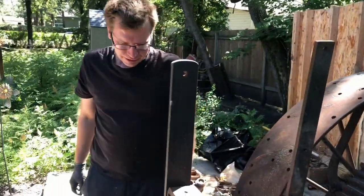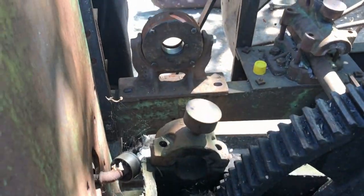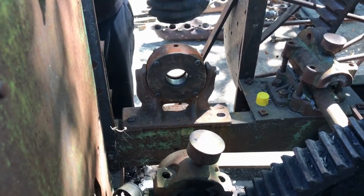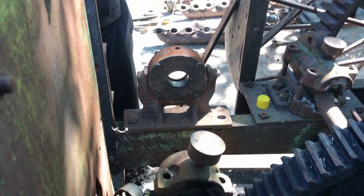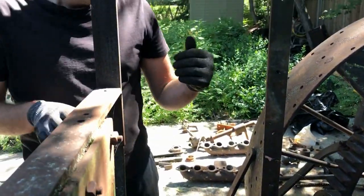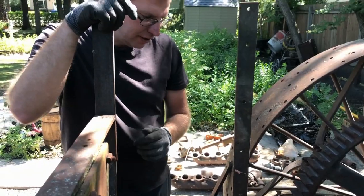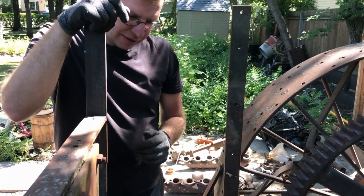What else? It actually runs in ball bearings here. They're a 6311 ball bearing. And the shaft actually slides back and forth in the shaft. On the unworn part, it seemed to be about a thou loose. Like I said, one we got was torched off, so I just ended up making new shafts for these. But yeah, it moves back and forth.